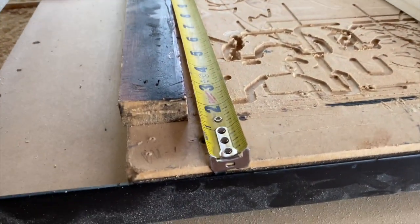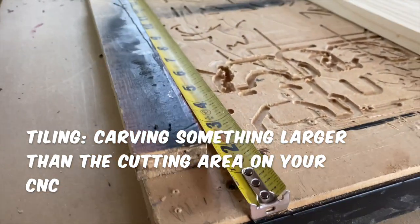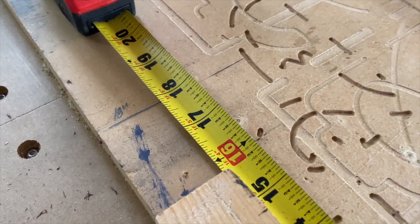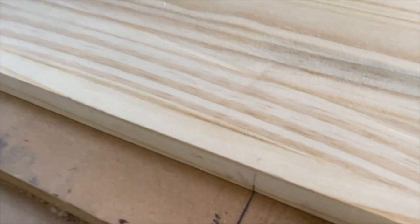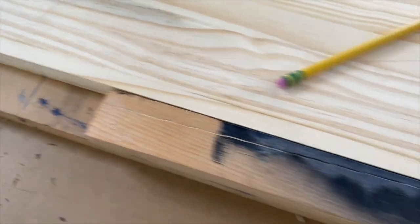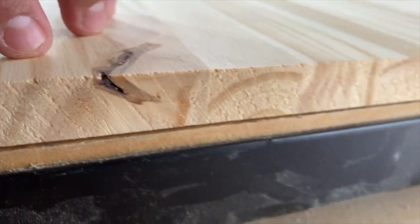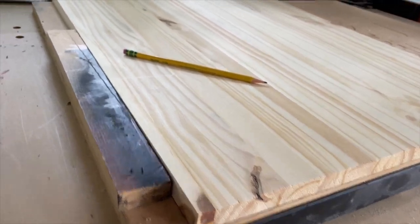In this example my flag is 36 inches wide, so I decided to make the tiles 18 inches. Prior to securing your material to the waste board you need to make some alignment marks. One 18-inch mark needs to be on your waste board and another 18-inch mark needs to be on your material. I measured 18 inches up from the edge of the waste board, made a mark there, measured 18 inches on my material, lined up the two marks, and secured my material to the waste board.